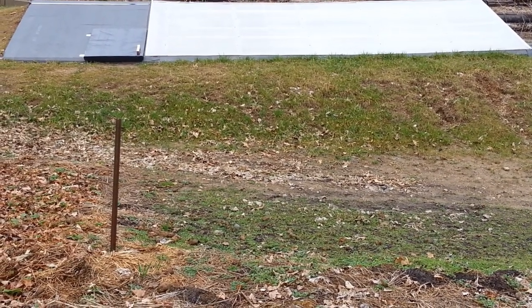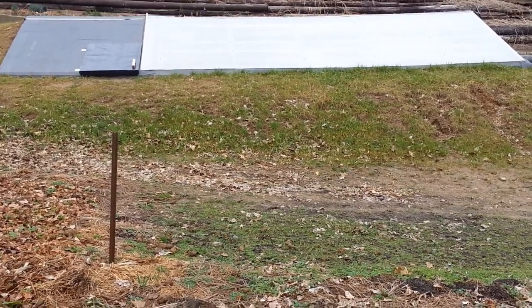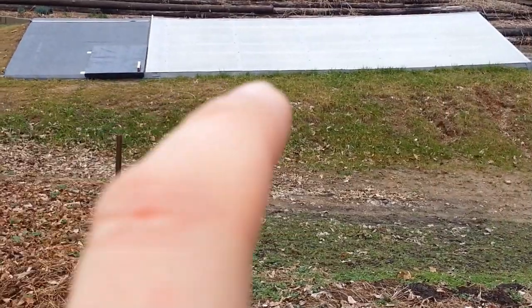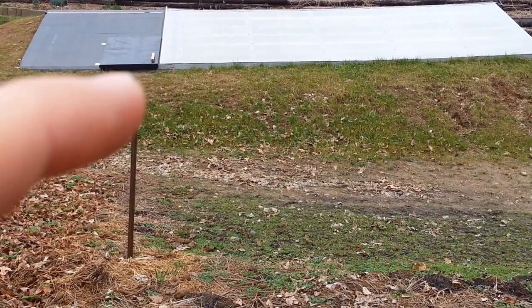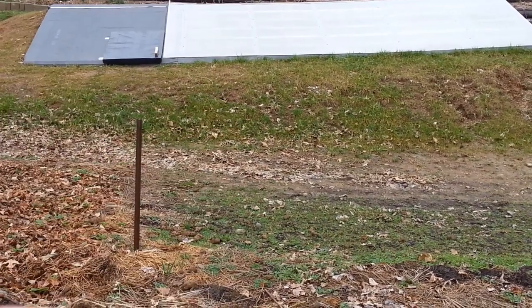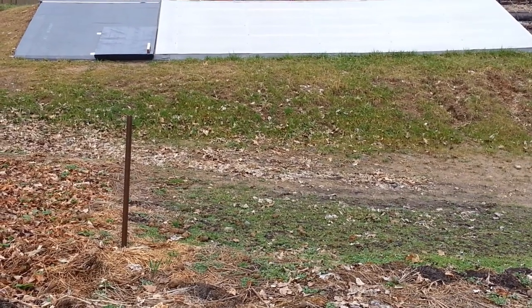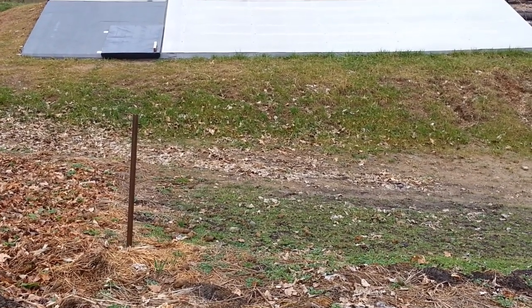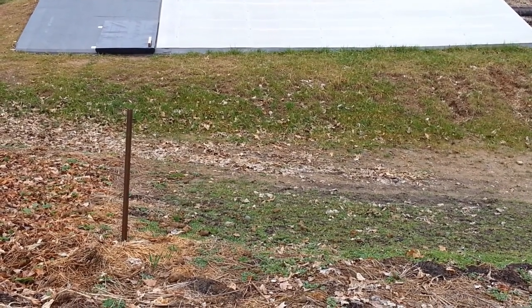I dug two feet down and four feet out on a slope from the wall. Then we put foam sheets down on the side of the house — four by eight sheets, that's why I went four feet out. Then we put plastic down, or in this case we used rubber, which you'll see right here. We put the earth all back down — you wouldn't know it was there because it's underneath the grass. So when the rain came down the side of the house, it would go into the ground but never penetrate past the plastic — in this case, the rubber.